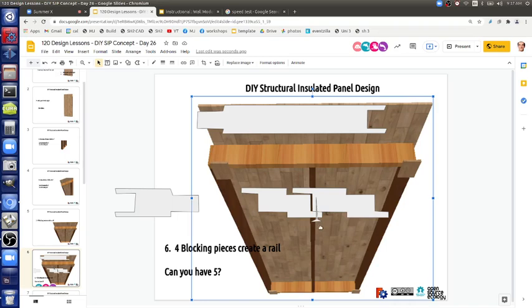Okay. Where typically will that work? The screw is going through the tab. You have nothing else. On the second floor, you don't have access to the outside to screw in the long tab. You'd have to have this tab pretty much the whole way down to get a better chance of pinching it together. In some cases of really bad warpage, simple screws do not work. You'd have to use larger screws like lag bolts, which is what we were fighting the whole time in the last build. Things wouldn't go in, so even with a pinch of the screw, it wouldn't align, so we had to use big lag bolts to actually get things to line up.